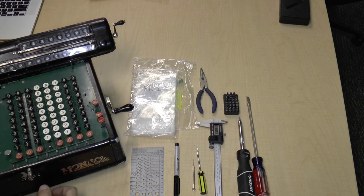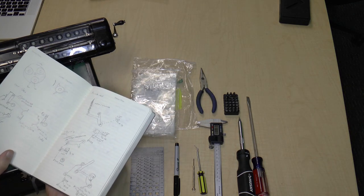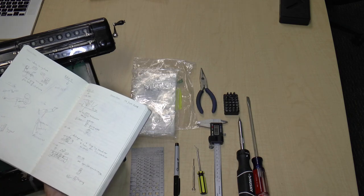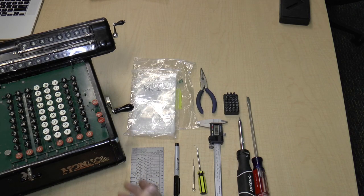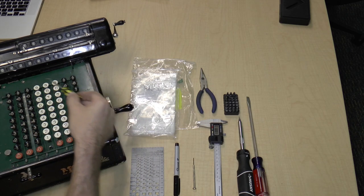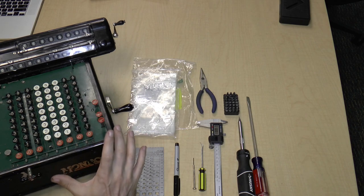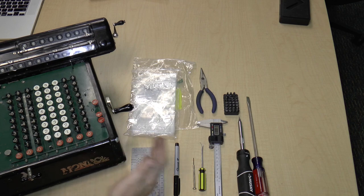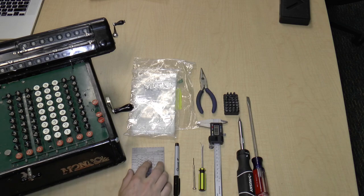I also have a notebook that I use to document where all these parts came from and where they go, so that I know how to put them back together again. I augment this by taking photos of every part before it comes off — I can also point at the part using a dental pick to know which part I'm actually taking off when I look at the photo later — and then a photo after I've taken the part off. This way I'm absolutely sure of the sequence everything was removed in.